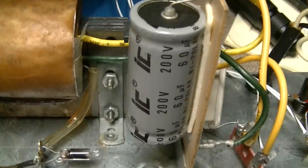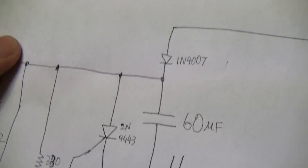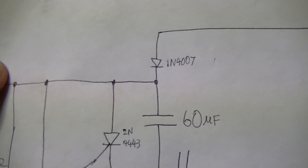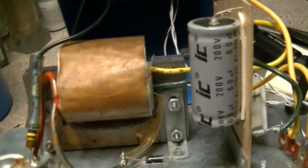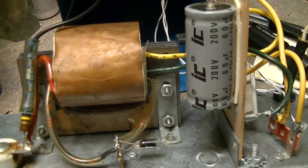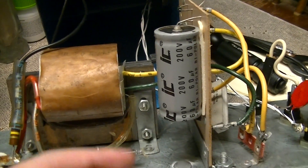Anyway, the way this device works — I've got the schematic all prepared. The mains input comes in, goes to the 500 ohm resistor and a 1N4007 rectifier, and charges up the 60 microfarad non-polar electrolytic capacitor — or bipolar electrolytic. The reason for that is, due to the nature of the circuit, there's a good chance of ringing from the transformer primary reverse-biasing this electrolytic capacitor, which could fry it if it were a conventional polarized type.